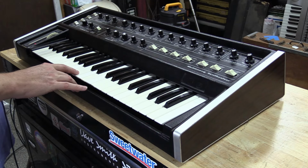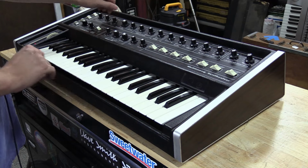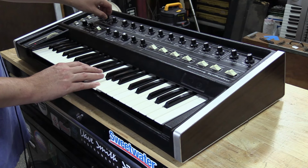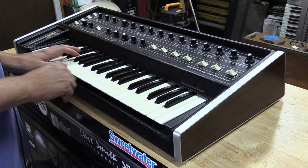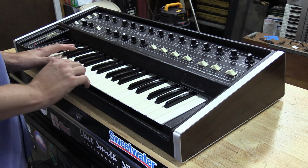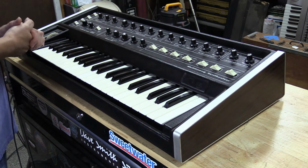So if we turn this knob right now, we're in unison or mix, we're going to turn A on only. So you can hear it gets a lot louder as you go to just one oscillator here. But here's oscillator A, so we'll go to the waveform. There we're at a square wave. Back at a sawtooth. So that's the controls offered by the oscillator A.